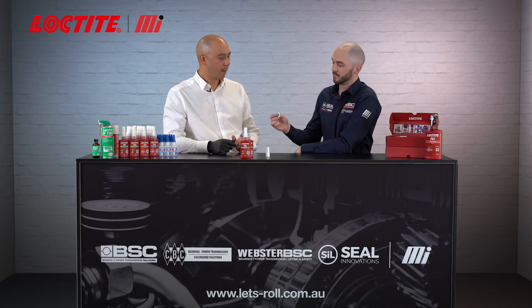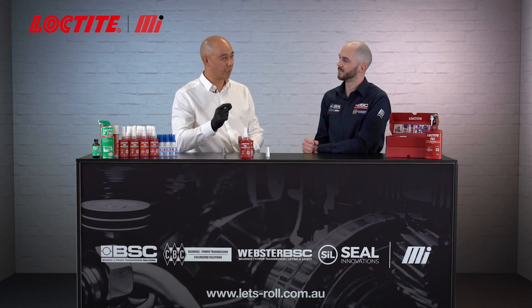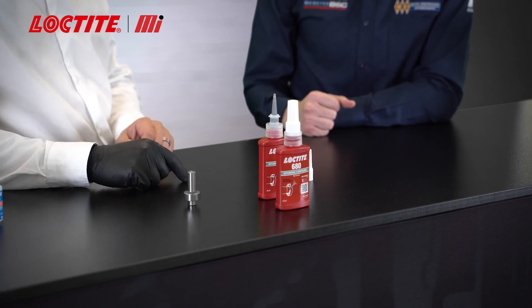Why don't you tell us the difference between using a Loctite and an interference or press fit? Well, typically industry is going to be used to things like press fits, interference fits, shrink fits. What we're saying is on a clearance fit we can actually have up to four times the strength. It can also be augmented into applications where you've got a shrink fit or interference fit, and again we would increase that overall strength up to four times. The other point to bear in mind is that no matter what mechanical way you have of putting a bearing onto a shaft, it's never going to give you a seal between the inner race and the shaft. Using a Loctite retaining compound, we ensure we get a full seal and that we're not going to get any fretting corrosion between those two mating surfaces.